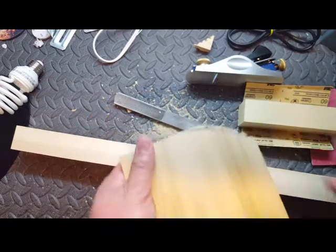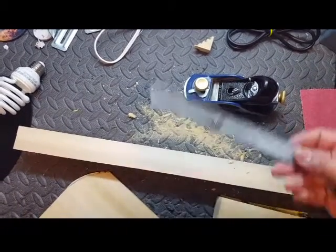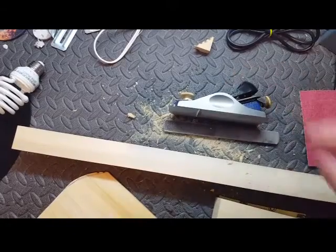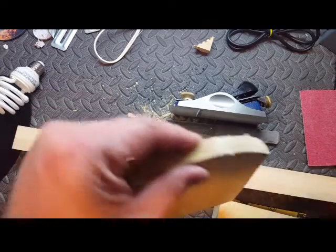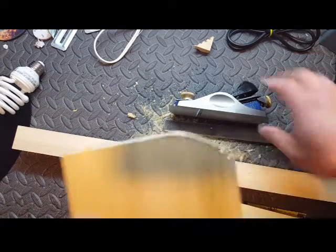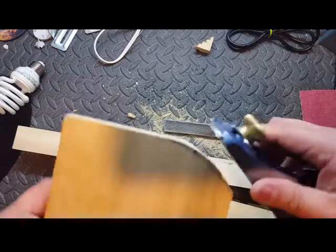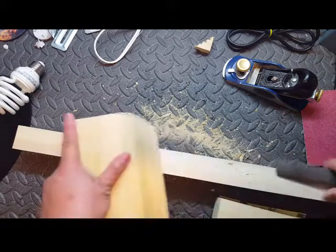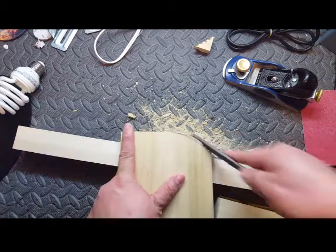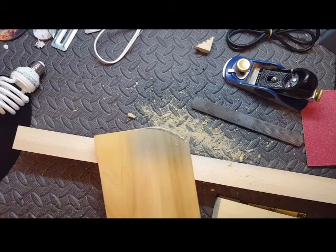It's really that easy with just hand tools. You can do it with hand tools — it's definitely possible. It's just a lot more wear and tear on your arms and you just gotta be patient with it. Take your time. You can easily mess a piece up, especially if your blade is sharp — that's why I generally don't use a plane for things like this unless it's a flat surface. The file, a rasp, and sandpaper — you can definitely get a lot of work done.